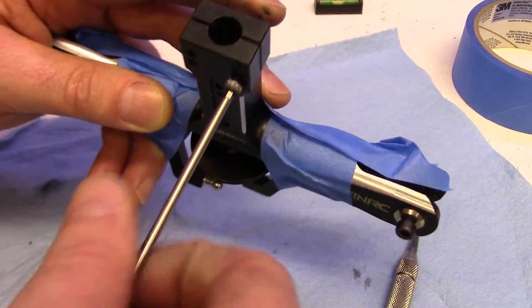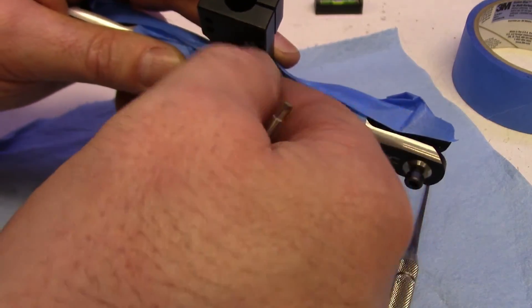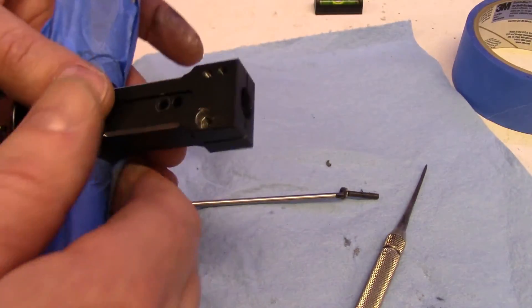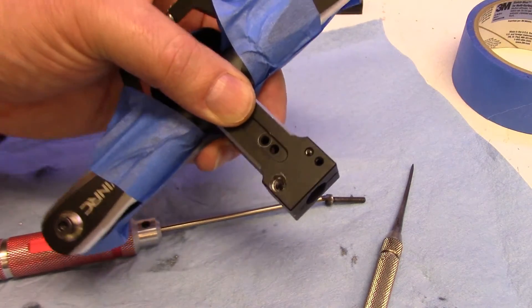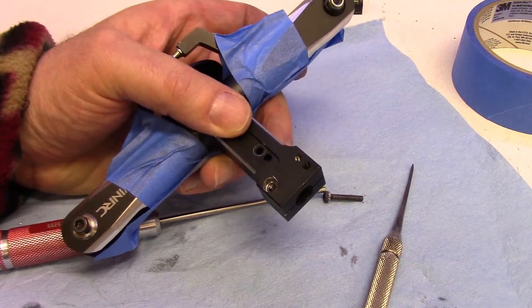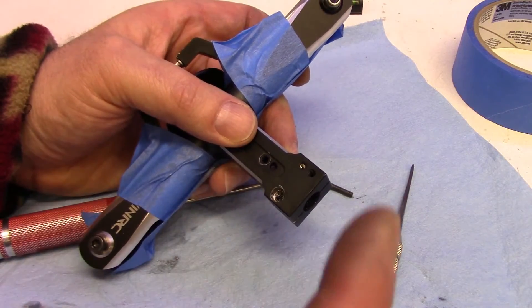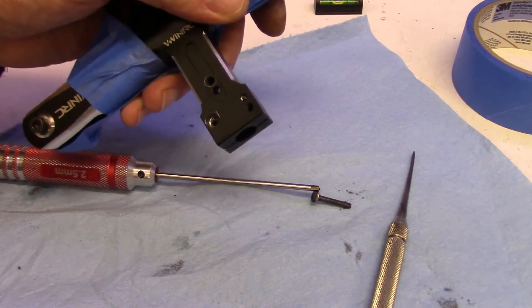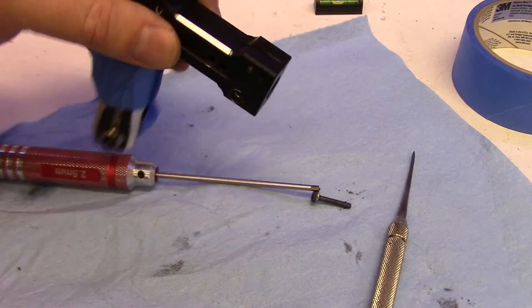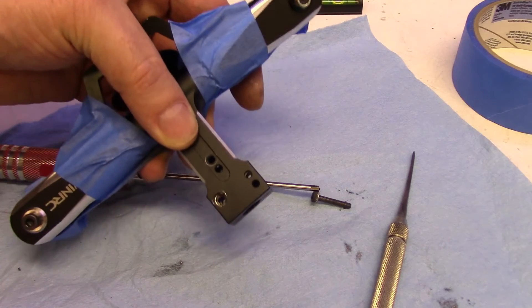The main thing is getting it centered. Even there, I thought I had it pretty centered, but we're off-kilter a bit — the drill bit did wander a little bit. But that's just one method to get a snapped bolt out: drill it out and then re-tap the hole. I go over that in my Setup and Tips eBook, along with other tips to get fasteners out if you round the heads off and whatnot. I just thought that might be interesting for a few folks if you ever run into this problem and have to drill out a small M3 bolt in a rotor head. Cheers folks!